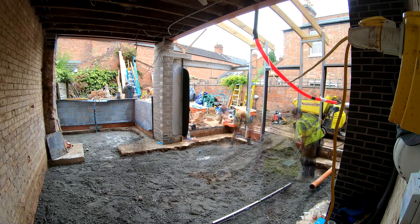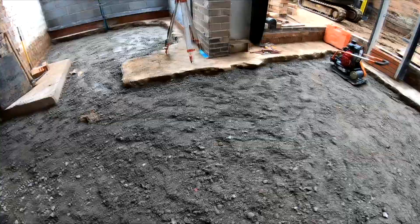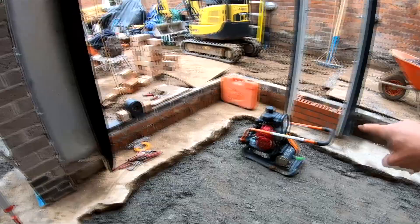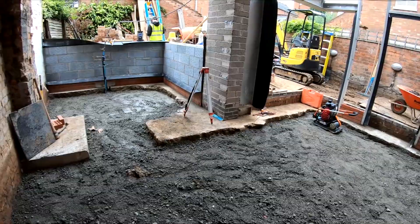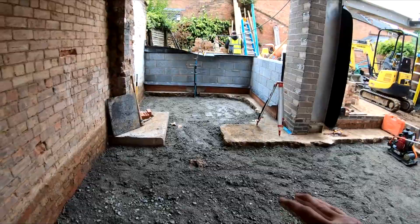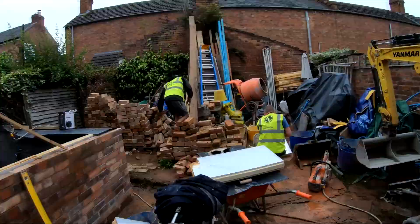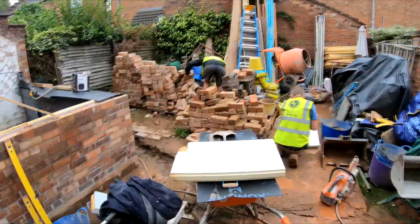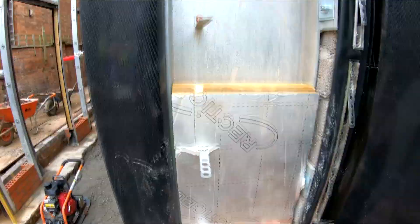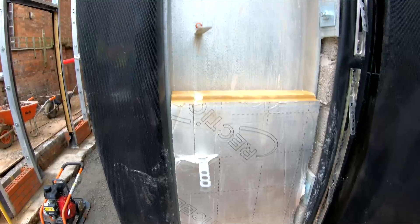At the moment we're putting the MOT into the subfloor. Once done, we get it nice and level using a laser level, then go around all the edges and work across with the wacker, crushing and compacting the stone down really well. Some people put blinding sand through but we put polystyrene down, then the DPM, then 150mm of concrete. Alex is getting on really well with the brickwork. We can see the insulation is taped up and the ties are being shot-nailed into the galvanized steel vertical beam.